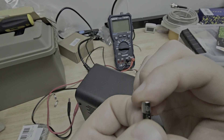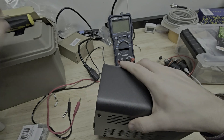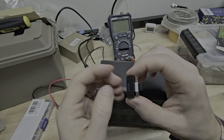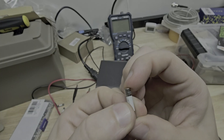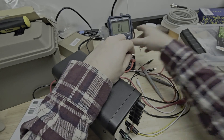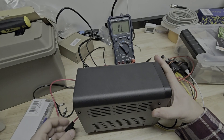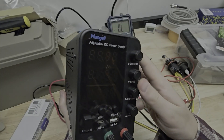This is the original — same thing. F10, 250-volt fast-blow fuse, same as the others I tried. You can see it's a normal kit of fuses, like what should be in it. The fuse blew, but too late, because you saw the smoke. Fuse is toast — there's my graveyard of fuses. Magic smoke came out of the machine too, so unfortunately this power supply is just dead.